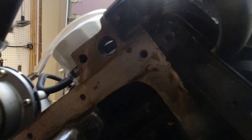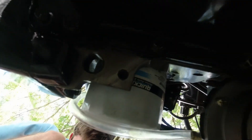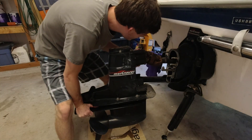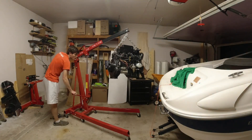Now to answer the question: why is the oil leaking? What you're looking at here is after I have the oil pan out, but I wanted to show a camera angle up at the front of the engine near the holes where two of the bolts go. The first thing I suspected was that those bolts in the leaking area had loosened, so I tried tightening them — but it still leaked after that, so that wasn't the problem. There really wasn't much more I could do to diagnose without removing the oil pan, and that's what ultimately drove me to remove the outdrive and the engine from the boat.